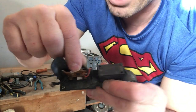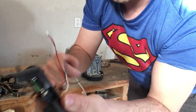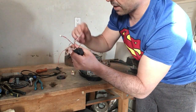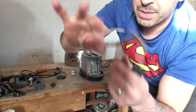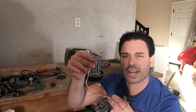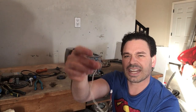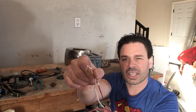There is a little bit of wire still in here — I will take these little wires and strands and put them into my 60% copper recovery. They are copper inside, so these are going to be 60% copper recovery as well. You do want to quickly check some electronics, as sometimes the wiring will be aluminum inside, but looking at this, that is a copper strand. The rule is one coating of plastic inside equals higher value, so here is your 60% copper recovery.